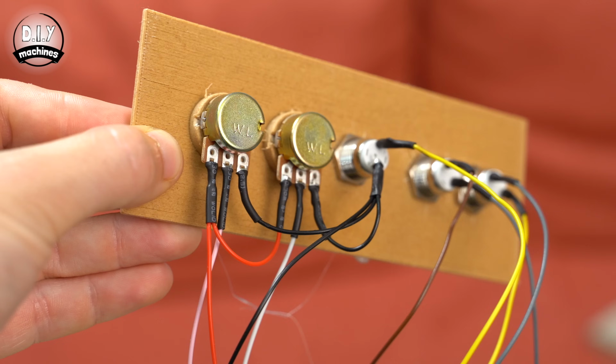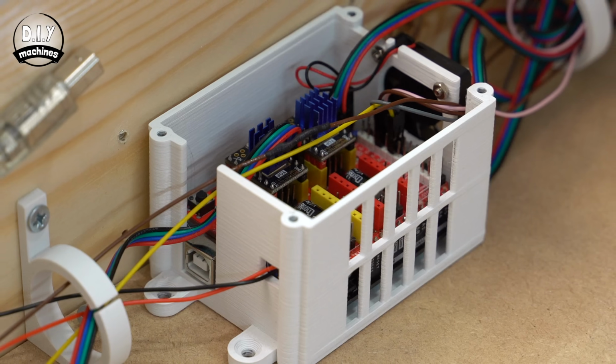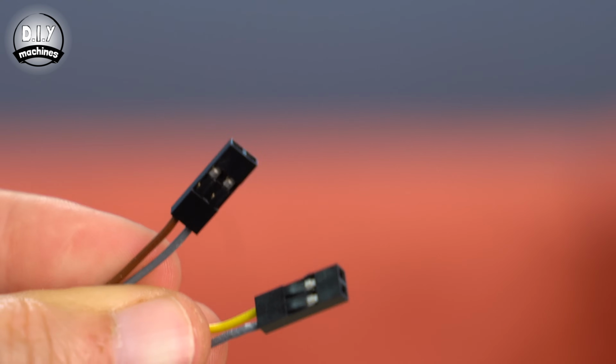Once your heat shrink is shrunk, the back of your control panel should look a lot like this. The last two buttons for playing and pausing the patterns in the sand will be attached to our CNC shield. Now I have gone ahead and added some DuPont style connectors to the ends of my wires so that I can easily slide them over the legs in the CNC shield. This is very easy to do yourself, and I have made a separate instructional video showing you how, which you'll find linked to in the corner and in the description below.